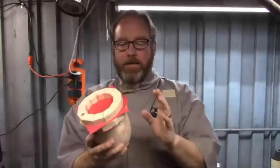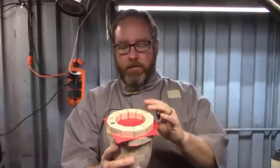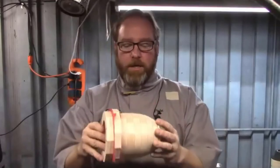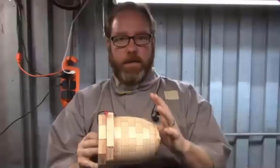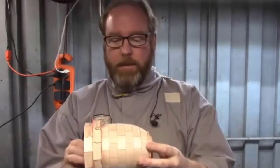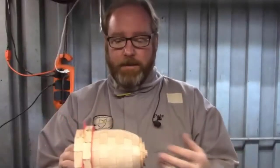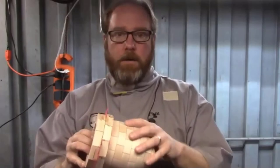You'll notice right off the bat that this doesn't quite look as simple and boring as what we've been designing. There was a question earlier about the veneer layers between. So I wanted to show you guys that there is a very simple way to take something like plain clear maple, which would make a beautiful tabletop because it's so clean but makes a boring turned piece. You can add dyed veneer between the layers, like the mortar in your bricks, to just give it some pop.